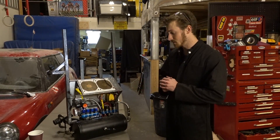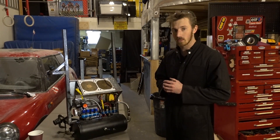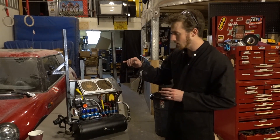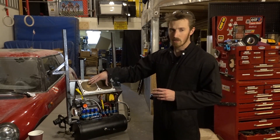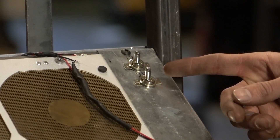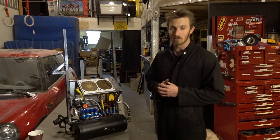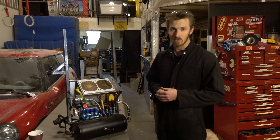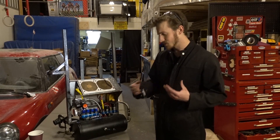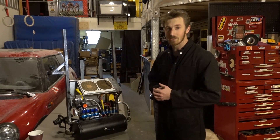We still have to wire the switches to actually control the solenoid valves for the leg pneumatics, but it's coming along pretty good. The fans were really powerful last time we showed them. What we've done now is, since they're on the buck boost converter running at 12 volts, we've also run them in series, so now each fan is only seeing 6 volts. It's much quieter now and still has pretty decent airflow — probably more than we need for cooling the air compressor. Thanks for watching, and stay tuned for the next update.